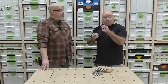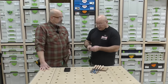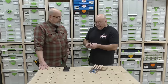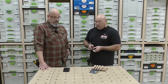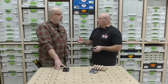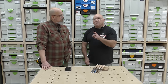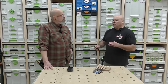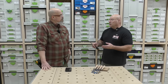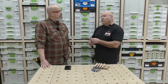It's the steel — its durability, how long the chisel will hold its edge. This morning I had a big box store chisel and tried paring with it. It came out dull as molasses. It's listed on the packaging as CR-V — chromium vanadium steel. I've had so many things over the years touting chromium vanadium steel; they don't hold an edge long. They'll get sharp, but they won't hold the edge.